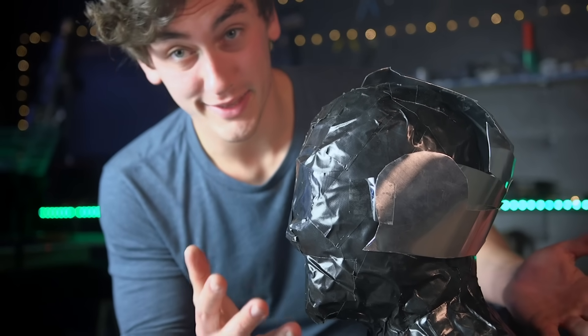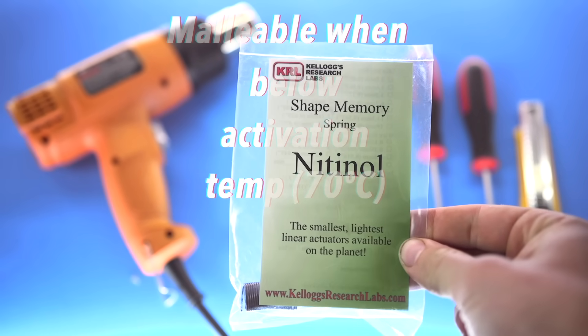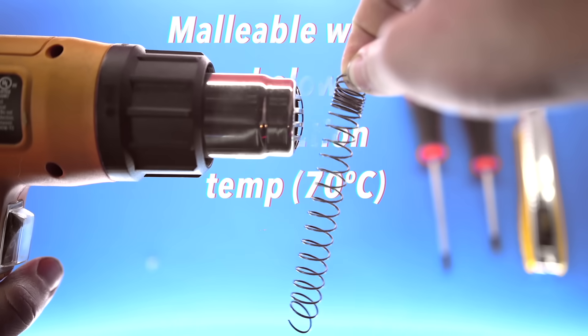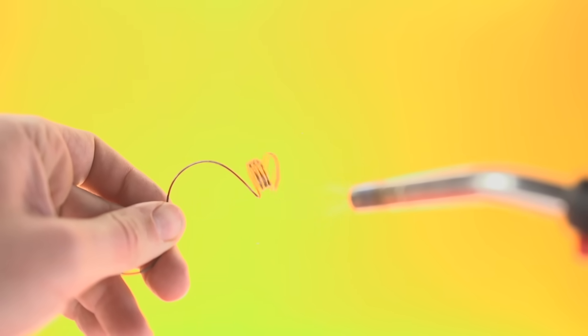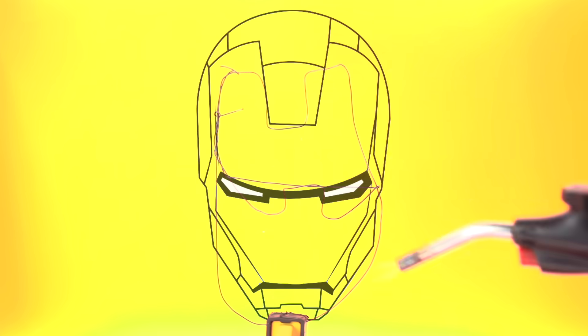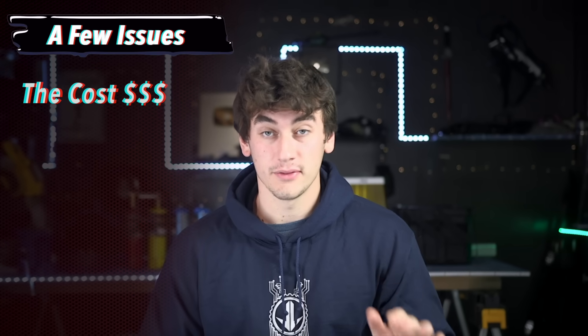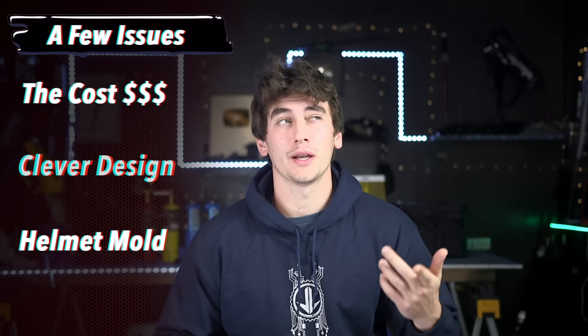Spin everything out kind of like a helmet visor, but it'll be like the whole helmet. I also thought about using nitinol — a nickel-titanium alloy — which is basically temperature-activated memory wire. You can program it into any shape you want by heating it up super hot and then letting it set. Then you can bend it out of shape, and it'll automatically return to its original shape when heated to the activation temperature. The advantage is it wouldn't take up nearly as much space as motors, and it's super simple. In theory you could make the whole helmet out of this nitinol stuff — just bend it around your neck when you're not using it, wear it like a scarf. Just heat it up to about 100 degrees and it'll spring up onto your head. And it's also super strong because it's made of titanium.